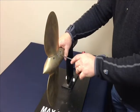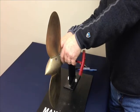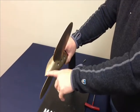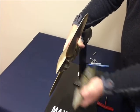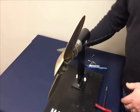Once you start on the sixth one, you need to start holding things together so you make sure that it won't fall apart on you. Once you get the sixth bolt out, basically rotate the propeller so where your line is over vertical, and this bottom half will come off in your hands. At that point, gravity is holding the other half on, so you don't have to worry about it falling apart on you.